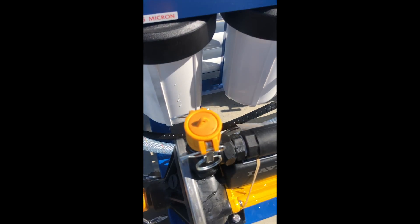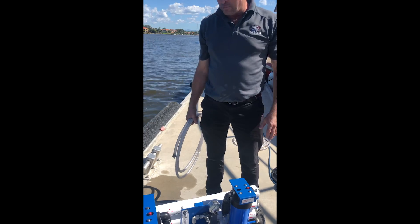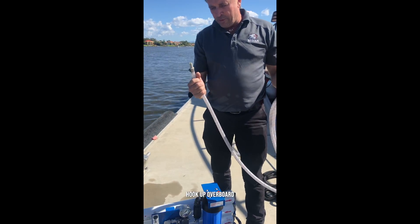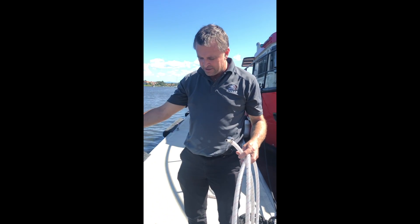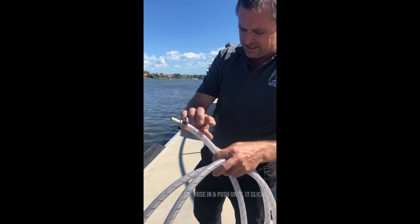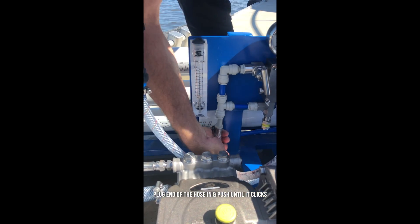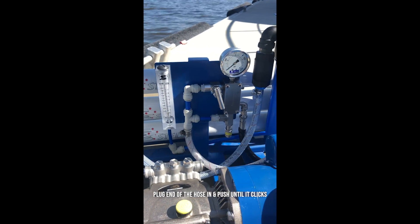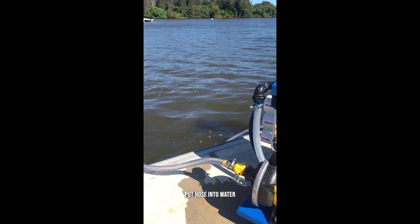Lock those caps on. Now that we've got the low pressure pump bled and water through the pipe, the next thing is to hook up our brine overboard hose. This hose delivers all the concentrated salt back into the ocean. It has a half-inch John Guest fitting on the end that plugs into the bottom here and clicks home. That hose then gets run back over the side of the dock into the water.